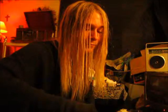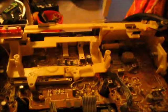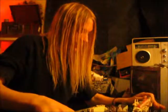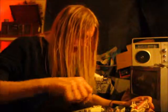If you run into the same problem and you can't get the dial strings working, as long as you can get your tuning selector to turn — if you have to, drill a hole in the back of the radio and put some kind of knob on it that you can turn. You won't have your full dial like you do here, but at least you'll be able to move the tuning selector and change your stations. Actually, it turns out I had this wrong — this right here connects to the circuit board, so you don't have to take off your dial strings. It all comes out as one piece. My last radio wasn't like that — I had to disconnect everything, which was really a pain.